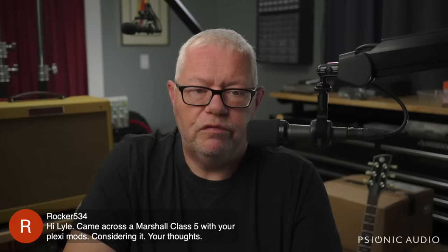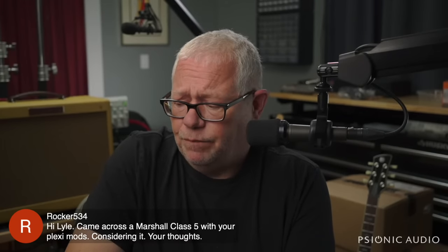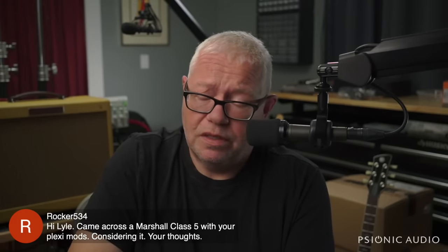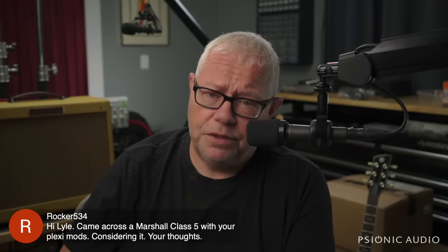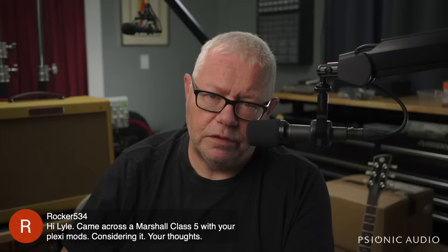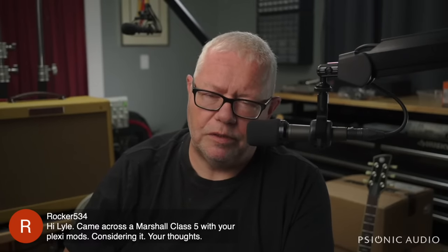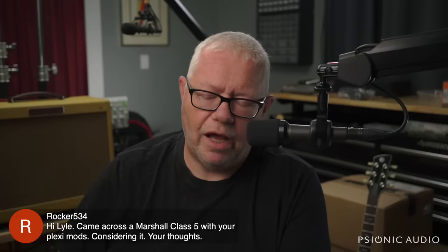Hey, Rocker534. He came across a Marshall Class 5 with my Plexi mods. Considering it, your thoughts. I don't know whether it's one that I did or whether it's one that someone did my mods to. Either way, honestly, I stopped doing them because even after I modded them and did all this work on a relatively cheap amp, including rotating the output transformer because they hummed in the first two versions of it, they would have other failures because the things were just made so fragilely. And I eventually told people, I'm not going to work on your amp because you're going to pay me $200 to make this sound good, and then something else is going to fail because they just cheaped out too much, and I felt bad.